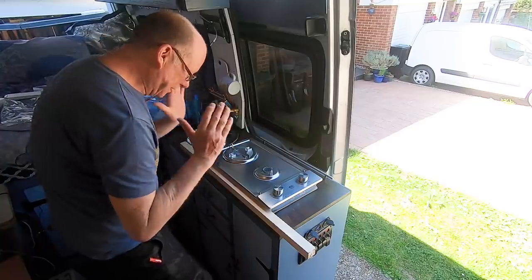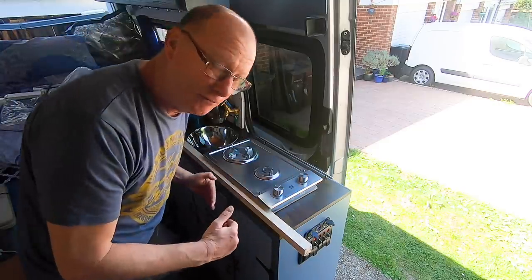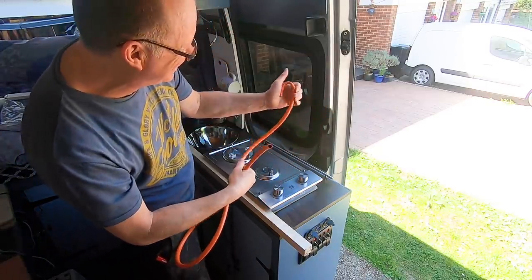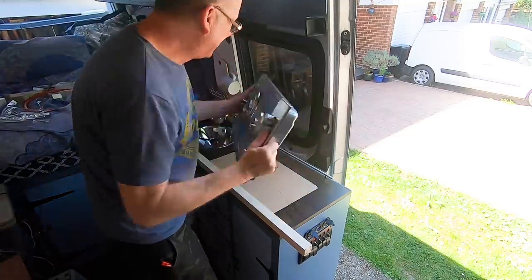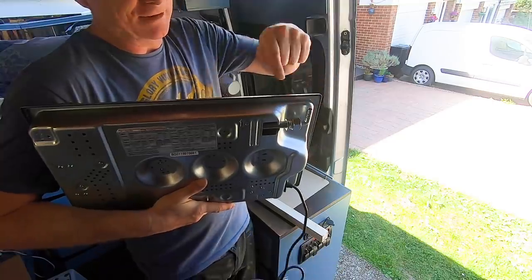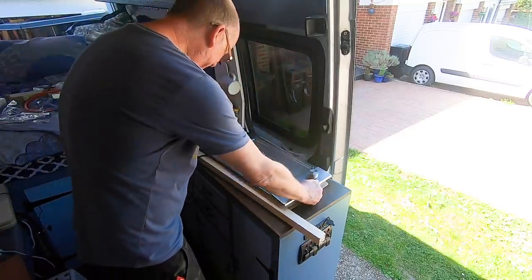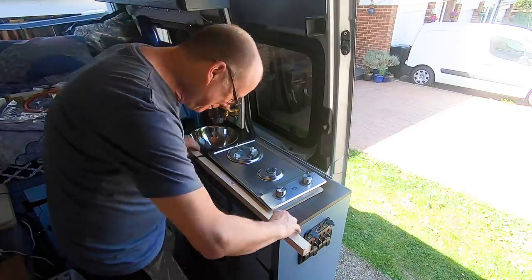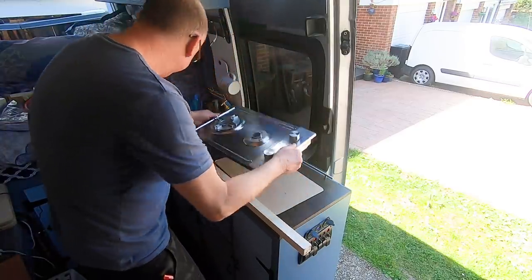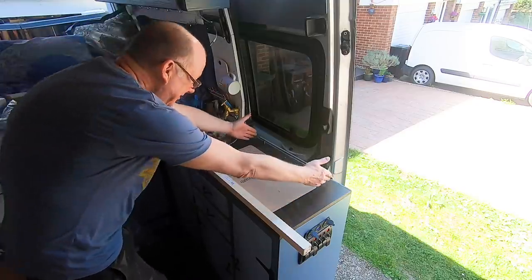I've decided to position it here. This is what my framework's made out of, so I've placed that on top so I know it's not too far forward, because I want it as far forward as possible to allow room for my gas pipe at the back to go round the corner without kinking. The gas inlet comes straight out there, so the gas pipe has got to come out and go round the back of my cupboard inside. I'm using this piece of timber as a guide, and now I need to mark using my template — put my template against there like that, and I know it's going to be exactly in the right place.